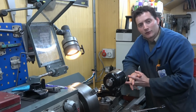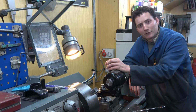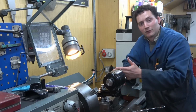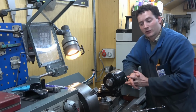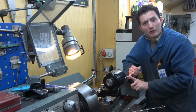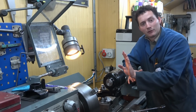Personally, I think both those comments are wrong. The amount of bar sag is, I believe, in the magnitude of half a thou at the most, and therefore is not the cause of the 7 thou error, and it does get you to within half a thou of a very good setup. So would I do the same again? Yes, but perhaps there's a few modifications that could be made. A stiffer bar, or a larger bar, or even better, mount the indicator directly to the spindle so there's no bar.